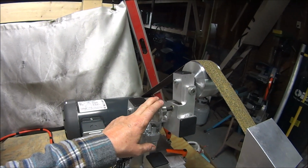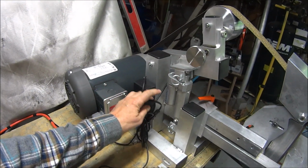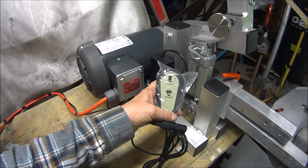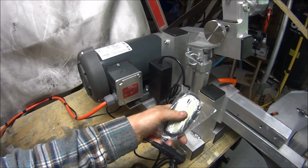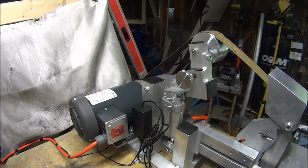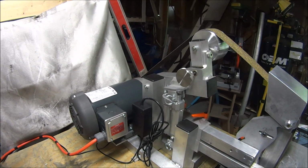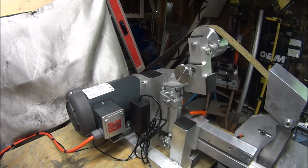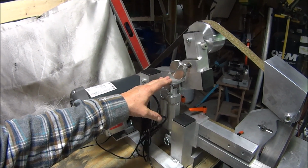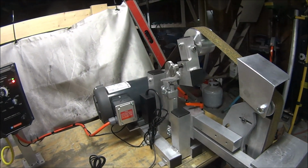The tracking system uses a linear actuator instead of a spring. It's got a 2-button system for up and down. So it has all the advantages of the high-end ratcheting tensioners such as the TW90 and the TX from KMG that has the ratchet. Only this, you can adjust this during operation of the machine. You don't have to stop the operation.